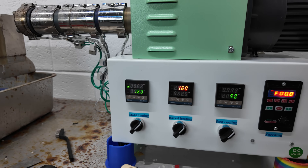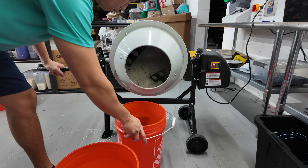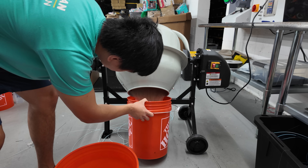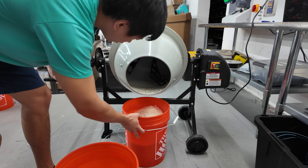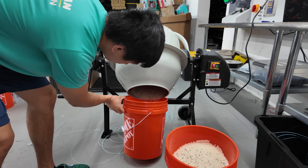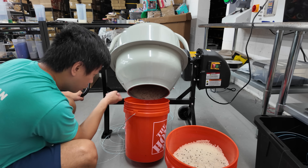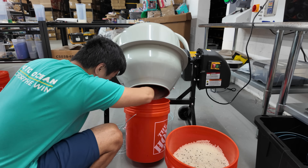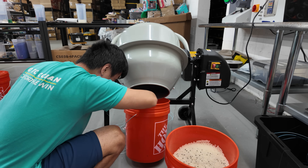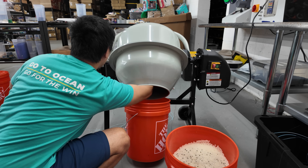All this mixing is being done while the extruder is heating up — it's been about 10 minutes and will finish in under 5 more. I dump the mixed material into the Home Depot bins. If the colorant at the end isn't mixed very well, I'll hand mix it when I pour it into the hopper. I use the cement mixer for about 30 seconds per batch and then dump it into the bins again.